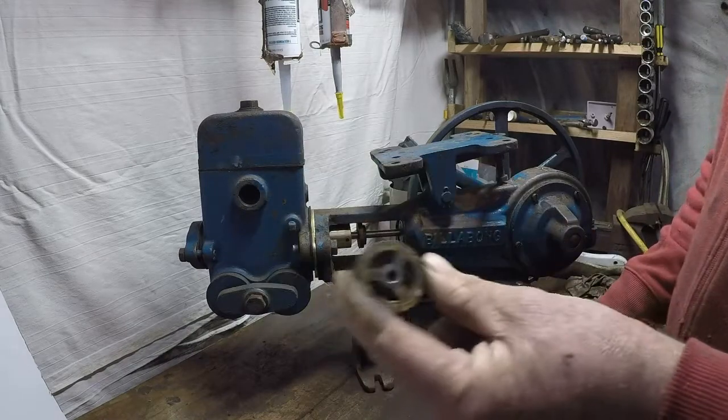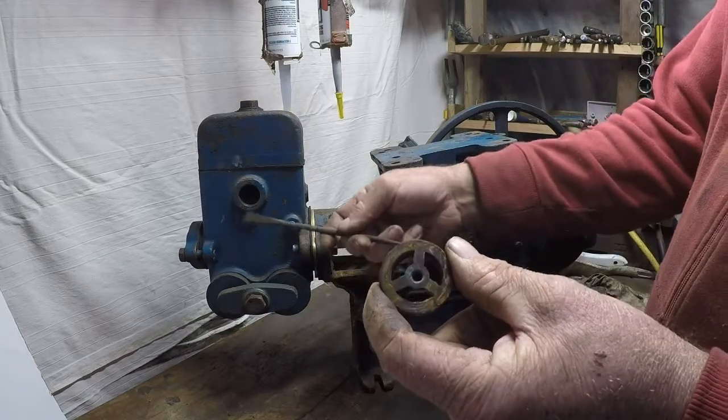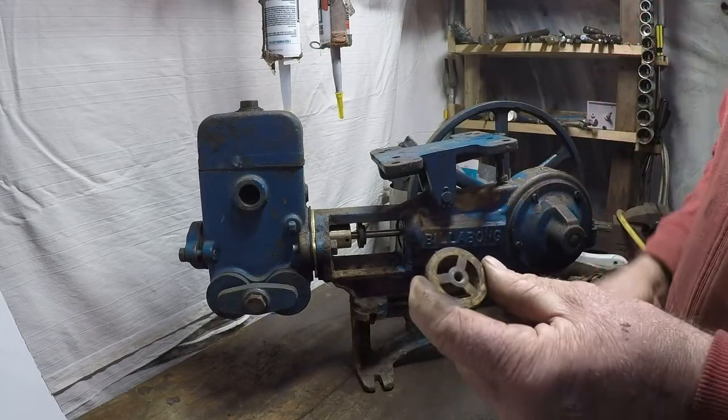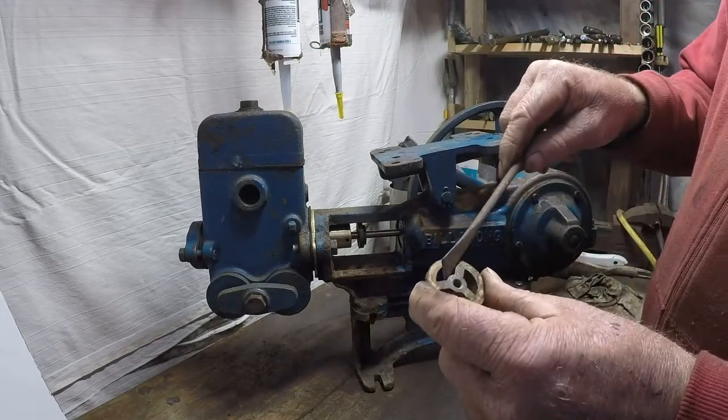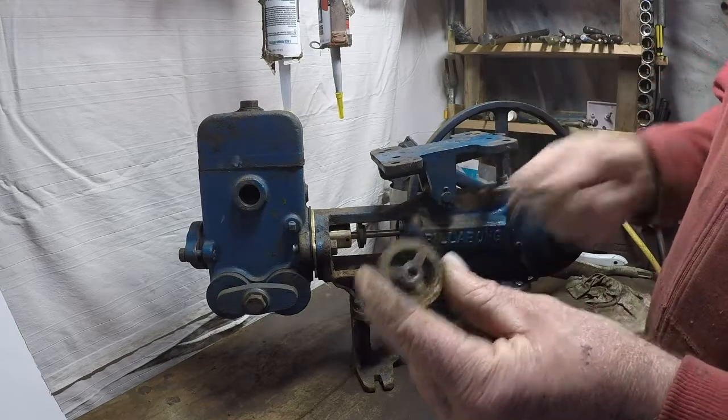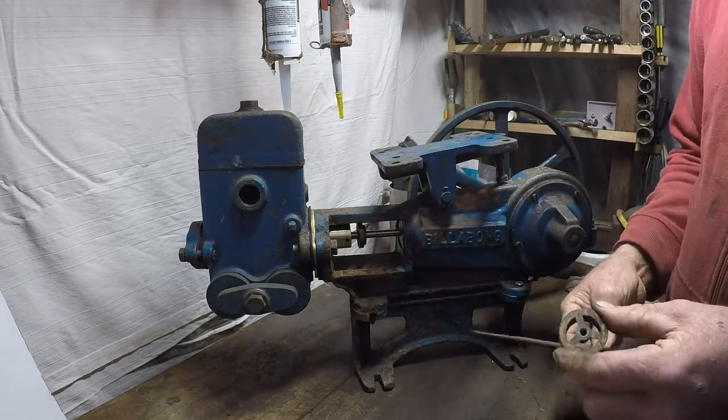So small gravel or even rust breaking off inside the chamber that's on the suction side there, that's this one underneath, that's enough to cause it. So it just stops pumping because it's just sloshing backwards and forwards.